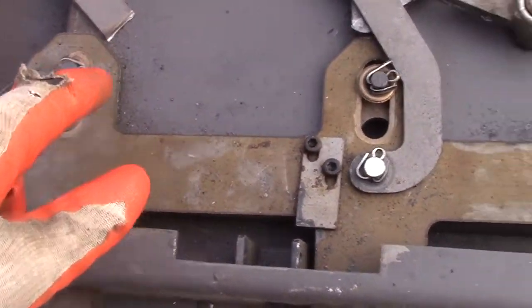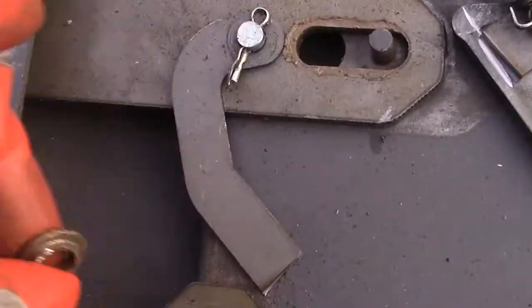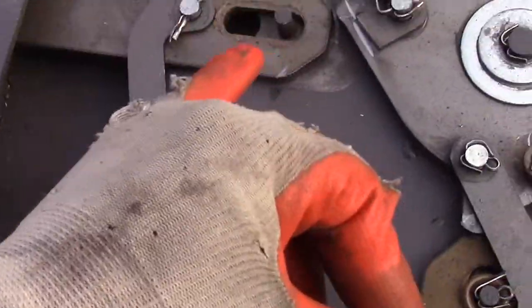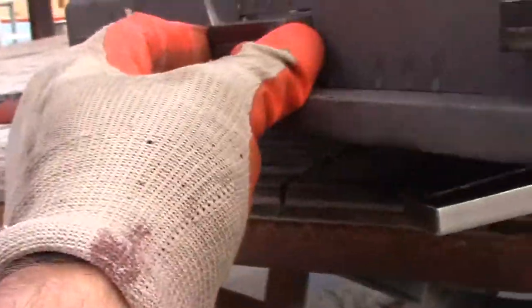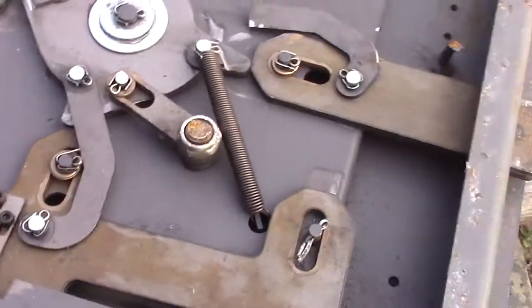What happened is they've got these bearings in here that are deteriorated, if not gone. This is supposed to be a sleeve that goes over the pin here and protects it entirely from the edge of this hardened steel member, but that's a lot harder than this stuff. So really they should have used polished materials of similar hardness, like stainless steel would work hardened, that would be fine, but they use this, I guess it's brass, I don't know. And consequently it got wobbly, and this piece on the bottom here, this is just a reinforcement plate. This one gets loose, and when it goes back in, it can lock in odd directions and it'll keep it from closing. So, I mean, McDonald's couldn't have that, so they had to replace the safe. So that was the defect here, is just the door design and using the wrong materials.